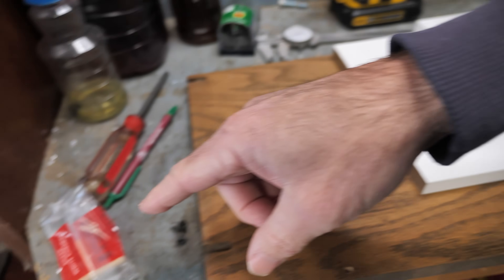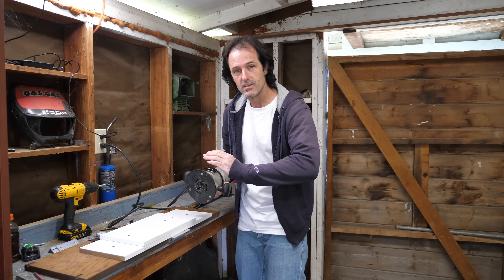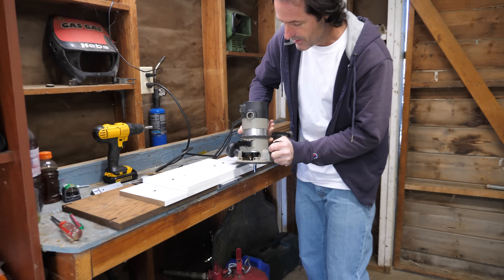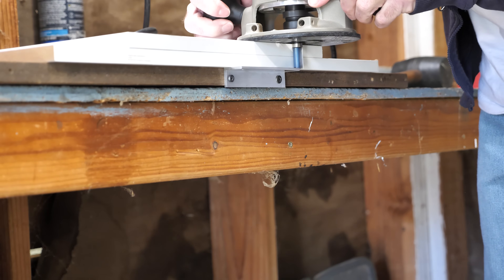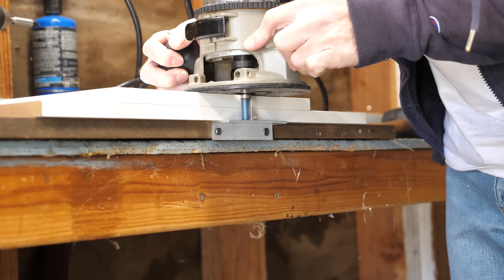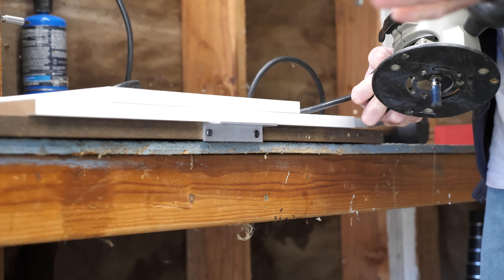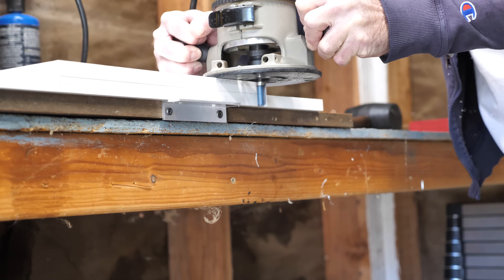You should also move your cheese unless you want it to be extra extra sharp cheddar. I'll make this cut in multiple passes, adjusting the depth a little bit lower each time. Really curious to see how this bit cuts using the bottom rather than the side of the flutes. You ready? Let's do that. Looks like it might work — I'll go over it a few more times, however many it takes to cut all the way through.